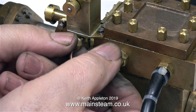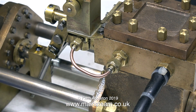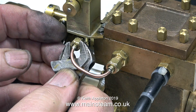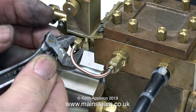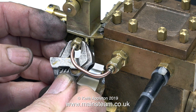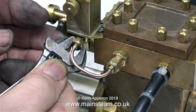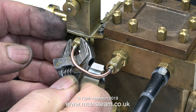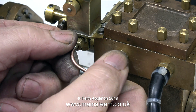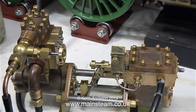Time to refit the pipe. Normally I would connect the output of a mechanical lubricator to a small clack valve, or oil check valve, fitted to the steam chest. But this doesn't use one of those, and time will tell whether I need to actually use one. The lubricator has its own one-way valve, but these are easily upset if you get any particles of dirt in them. Because the lubricator hadn't had any oil in it for a long time, I did notice a very sticky residue of old steam oil in the cap, which may have fallen into the oil and got jammed in the valve.